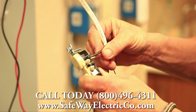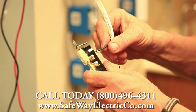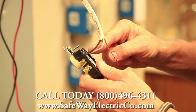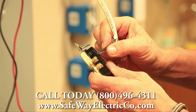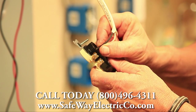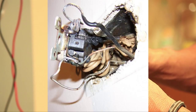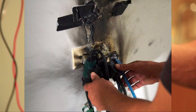This is an acceptable wiring method, but it is not really recommended. From our experience, we come into homes and find outlets overheated and circuits that go down, and usually it's because of this type of wiring. The wire is just held in place with spring tension, and over a period of time because of the heat and electricity, the spring becomes weak and the connection becomes loose, generating heat.